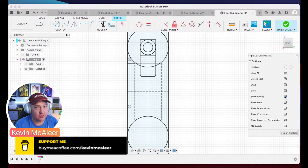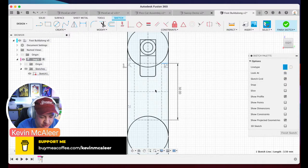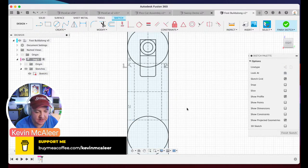effect that occurs when you've got a design which is fully defined. So in fact, if we just open up our little sketch here, we can see we've got a fully defined sketch. Everything's black currently, so we've got the little padlock, which means we're golden, even though we've not finished yet. Just from a perfectionist point of view, I'm just going to make that little line there just a construction line. I'm just going to replicate that down there as well. It's just quicker to do that than mirroring it for these particular ones. So I'm just going to hit X and then X again to make them all construction.